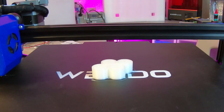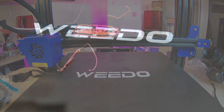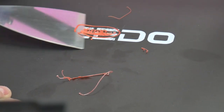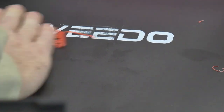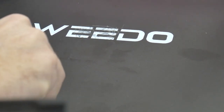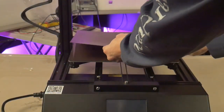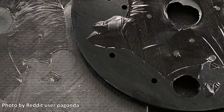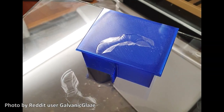Just in case it was an issue with the sample filament, I tested with PLA, PLA plus, and semi-flexible filament, all with similar results. I'm not sure what coating is used on the spring steel build surface, but prints stick to it extremely well — so well, in fact, that the bottom couple layers of the model would tear away from the print and stay on the build surface, whether I tried pulling the print off directly or by flexing the steel surface. I tried printing on the opposite side of the plate but couldn't get anything to stick on that side. I resorted to using a different spring steel sheet with a PEI coating that happened to be the same size. If I use the ME40 build surface again, I will need to use glue stick — not for adhesion, but as a release agent so I can get the finished prints off the surface.